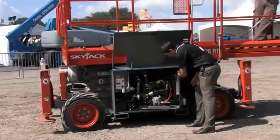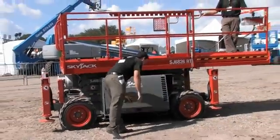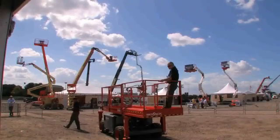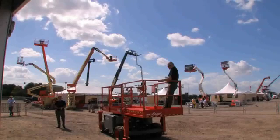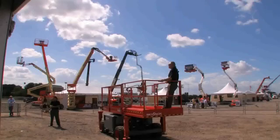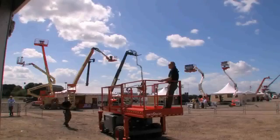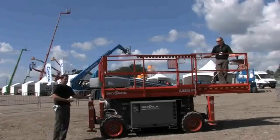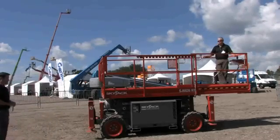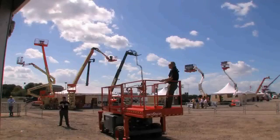This is a 4-wheel drive machine, and one of the things that we always have an issue with in any hydraulic drive system, we're using 4 hydraulic wheel motors on this, is that you always worry about loss of traction. When a hydraulic wheel motor starts to slip, it will actually rob power or rob flow from other wheel motors. So you use things like flow dividers to try and combat that, which work like a differential would on an axle-based system. But that doesn't always help. In muddy terrain, just having a simple flow divider can still sometimes leave you with a complete axle dead.